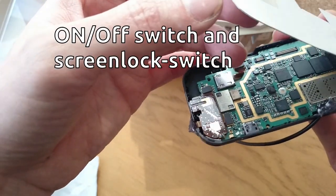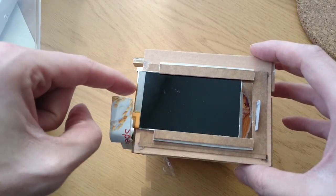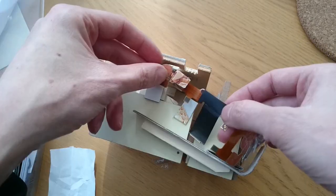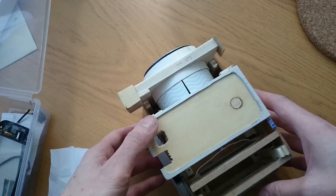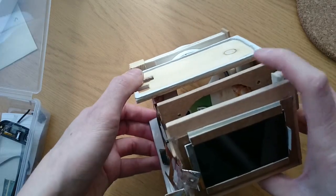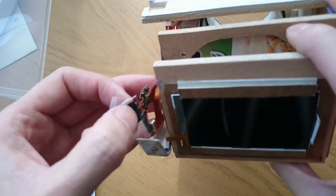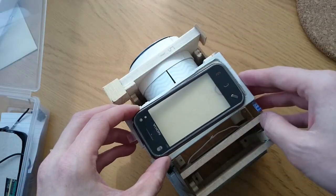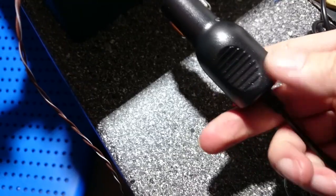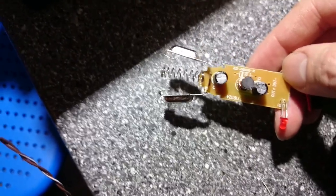Everything together. The switches get cables attached. The screen slides into this window here like a drawer and is carefully held in place. The fragile cable is held on the left side by some cardboard clamps, and the phone sits on the side at an angle so that the fragile cable is bent as little as possible. The right side of the cable plugs into the LCD and the left side into the touch screen which sits on top of the projector. For powering the phone I used the guts of a car power adapter that can run on 24 volts.